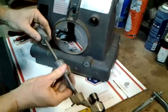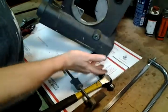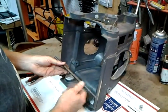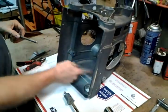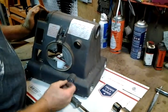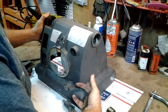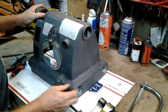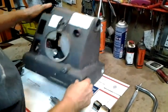That's all there is to the headstock lock — a few common problems, pretty easily taken care of. It's best to take the motor off so you have access to all of that, and if you're doing things like sawing the rod in half, you don't want metal shavings falling inside your motor anyway. For customers who've sent their headstock in for repairs, I always send it back with the wedges down. But if you go to put it back on your way tubes and it stops partway, it's just one of those wedges out of position from shipping — reach in by hand and rotate them to get the flat side down again so the way tubes can slide on easily.